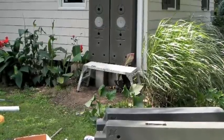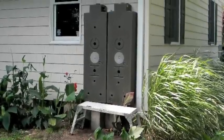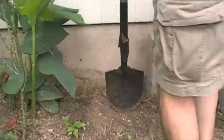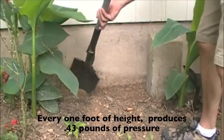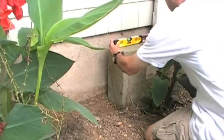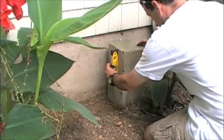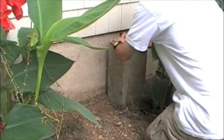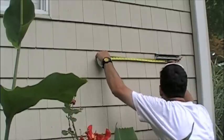If we invested in the proper systems, we could provide 100% of this home's water needs. So let's get started. I have opted to set both hogs on concrete blocks. One advantage is that it will further improve water pressure, and it just makes filling containers easier. Making sure the block is level and plumb will give the Rainwater Hogs a stable platform.